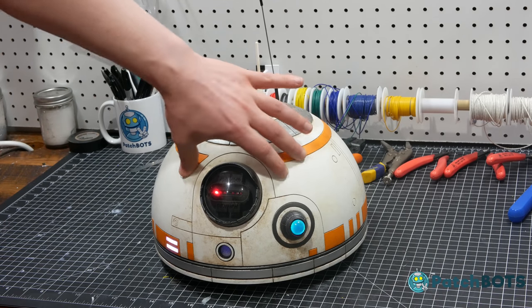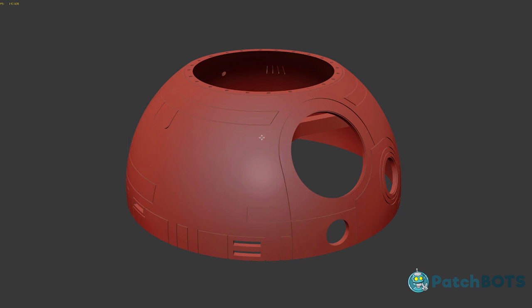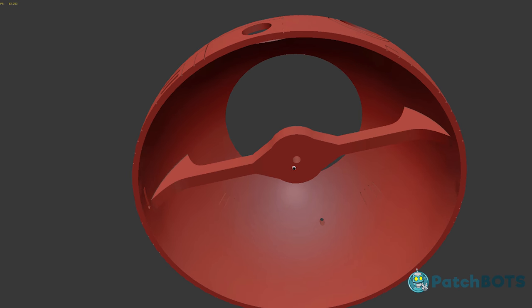The next main parts that were modified were the dome and the skirt ring combo. The dome on the outside is relatively untouched — I did most of my changes to the inside structure. I deleted the inner rim which used to have holes to attach to the top of the dome ring. I left a small brim so it can glide above the dome ring. I also added in this cross brace, which attaches to the main mechanism and gives you a lot of mounting room for electronics and batteries.